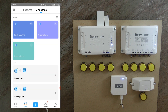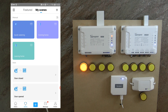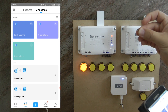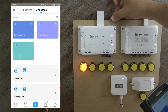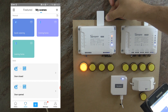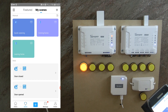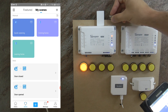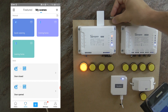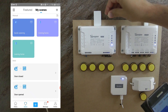Let's verify both scenes: moving the sensor apart turns channel 1 on, and bringing a single small magnet close turns it off. The small magnet seems marginal — there appears to be a sweet spot — but a larger magnet works reliably, though a very large magnet also triggers the metal in the battery case unintentionally.